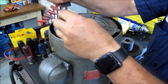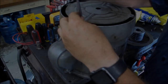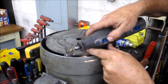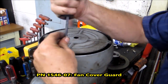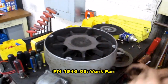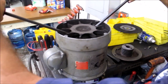Occasionally you get one like this where the slot is closed up, so you have to open up the slot so you can actually get a screwdriver in there again. Take the top cover off and you're going to see right underneath there's your fan and accompanying dirt. Two pry bars — this is a plastic fan, there's no key, no nothing, it's just kind of pressed on.